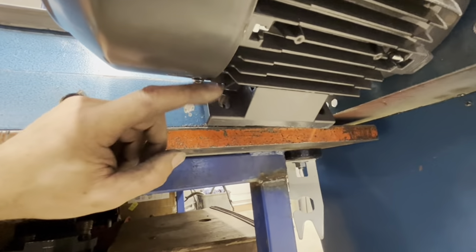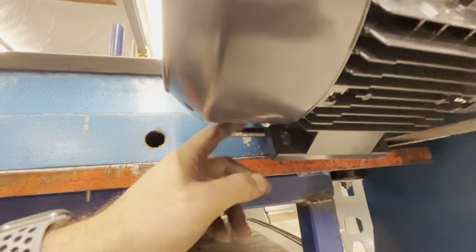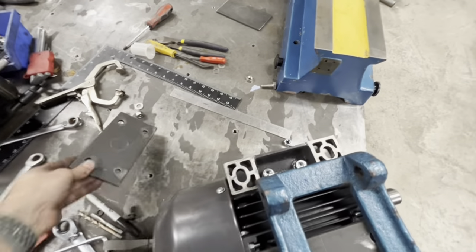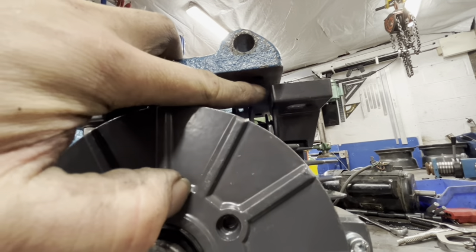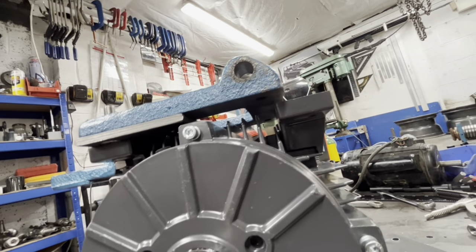So it's just going to be these plates. We'll take this back off and make the bottom one, which should be easier because all the bolt holes don't have to be captive — just drill and bolt. The top one was all countersunk because the bolts are in the way. The bottom one literally just has to go in there — drill for the two bolts and they should just about clear. If I put allen head bolts in there we are good to go. Quite easy really, just a couple of square plates.